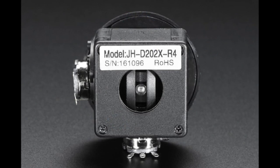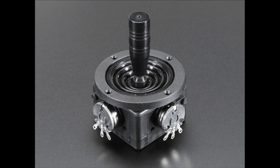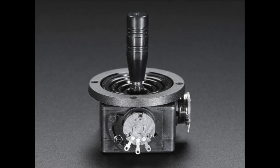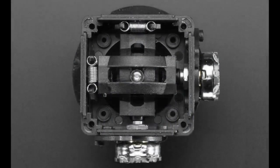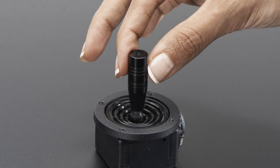Next up is the analog joystick. This is a small analog joystick that has two potentiometers. Compared to a lot of joysticks which are tactile switch-based — with a switch for left, right, up, down — this has two potentiometers and a gantry-type mechanism inside with return springs. It's very small and cute.